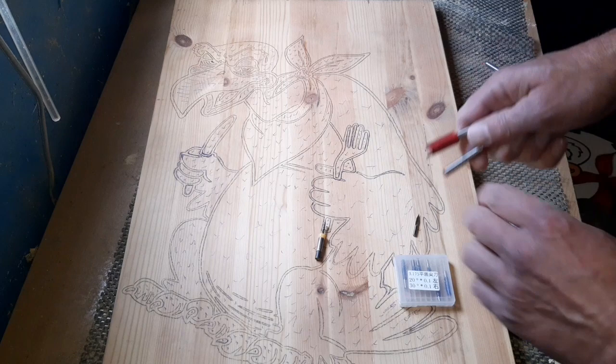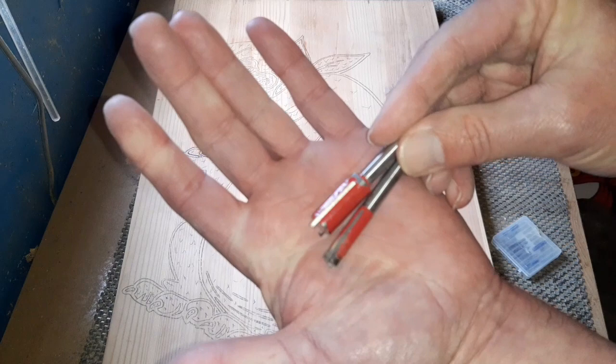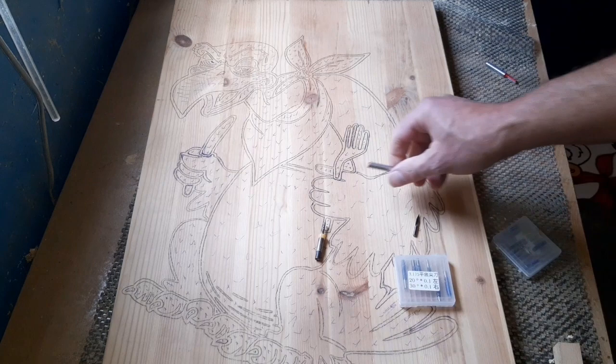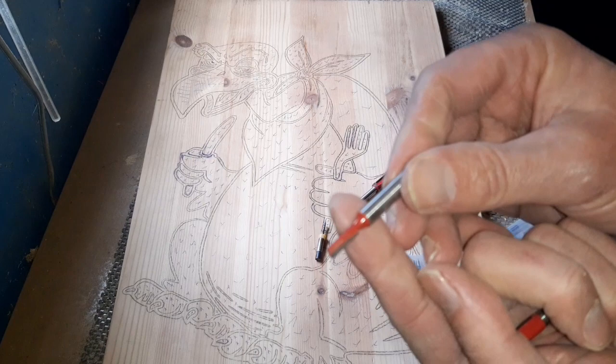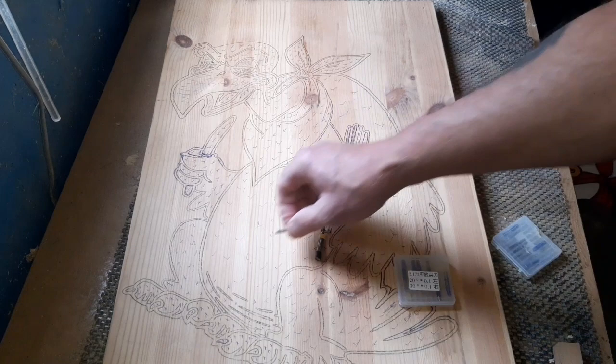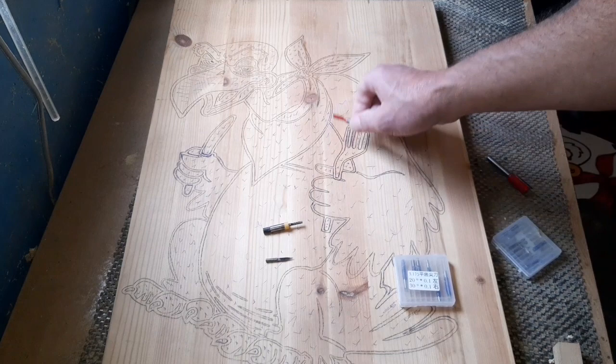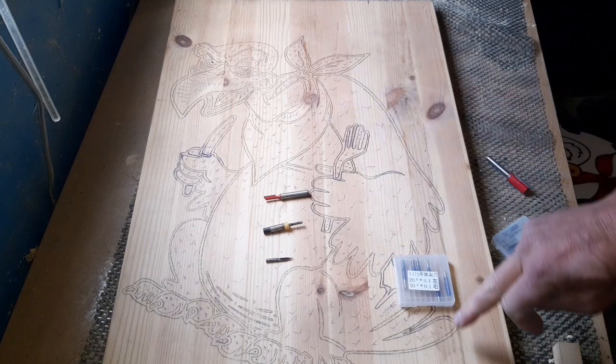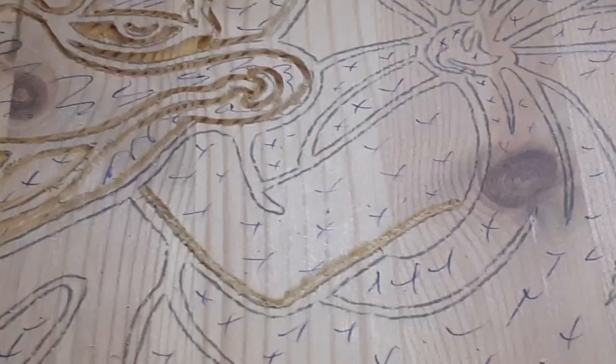If it's a little bit slow, I use these double flute straight flush bits — they'll be in the description. That would be too aggressive for the small sections; it would snap the bit off no problem, so be careful of how aggressive they are. We'll put a small one on — one eighth — to remove the bigger sections. So: CNC bits for the lines, end milling bits to clean out, and if it's a slow process the straight flush bits to clear out as well. Let's set this all up on the router, route it all out, tidy up, and then we're going to cut it out on a scroll saw.